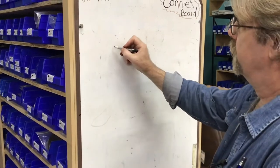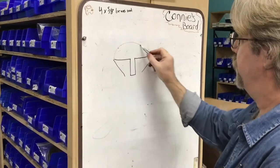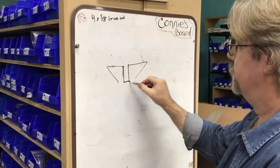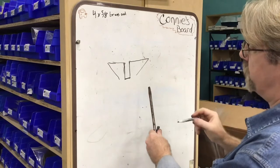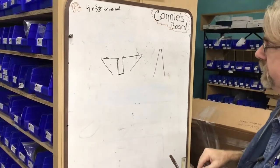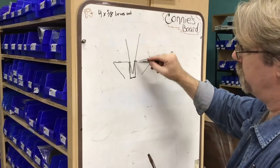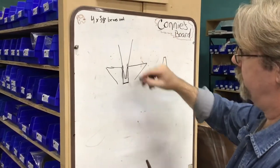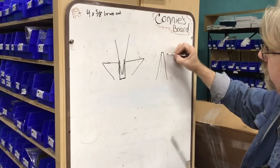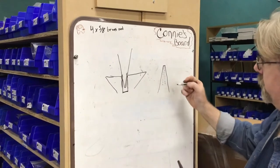Here's why we want to do this. The slot in a typical screw — whether it's a flat head, round head, or even an oval head — is going to have straight sides and a straight bottom. And almost every screwdriver tip that you pick up from a home improvement or hardware store is going to have a wedge tip like this. When you try to use that inside the slot, what happens is this angle bearing against the sides causes it to cam out and usually burrs the edges of the screw. So what we're going to do is actually sand this screwdriver so that it has a shape that more closely matches the slot of a typical wood screw.